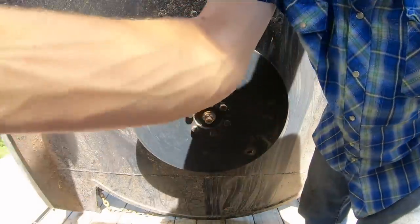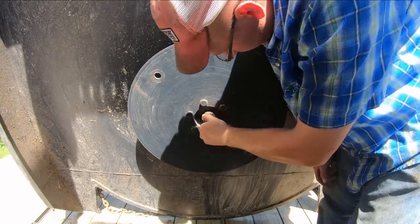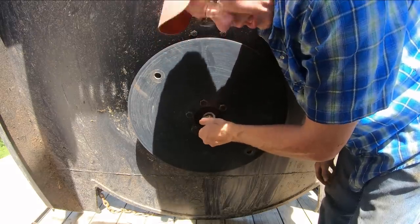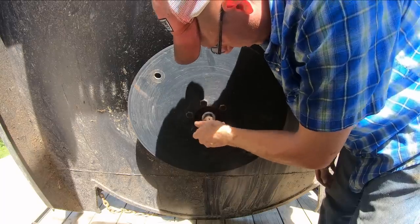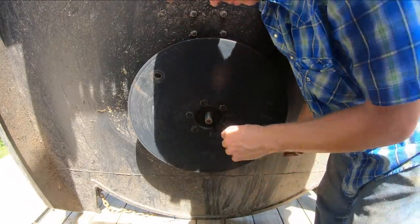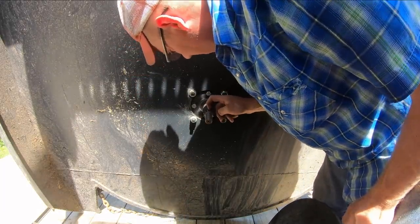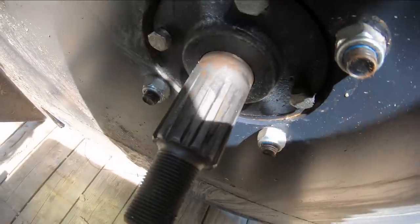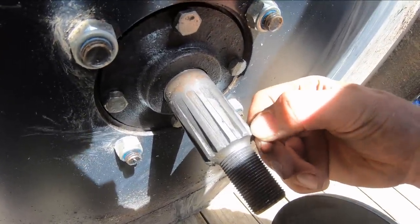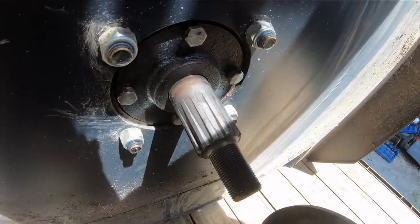The nut was loose — the only thing holding that nut on there was the cotter pin. That's why it was a little difficult to get out. The same thing that happened to the blades would have happened to this disc had I left that go unchecked. Unbelievable. The threads still look all right, but there's a thin piece of crap washer. Our splines look all right although they're not very beefy — it's a tapered spline, maybe an eighth inch at the bottom tapering up to nothing over maybe two inches. Not a very aggressive spline; that's going to strip out in time, I'll almost guarantee it.